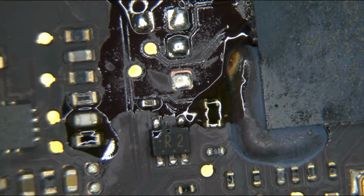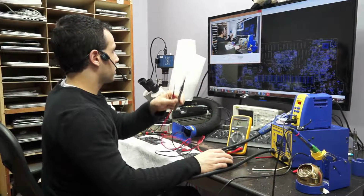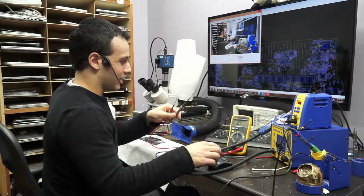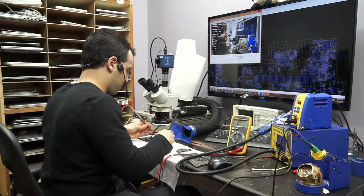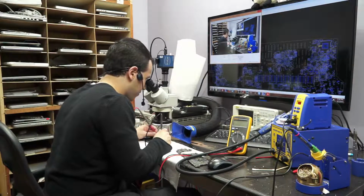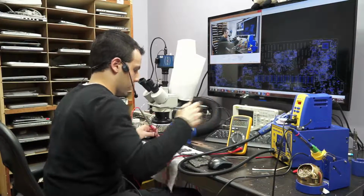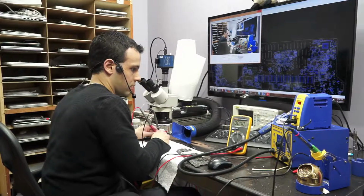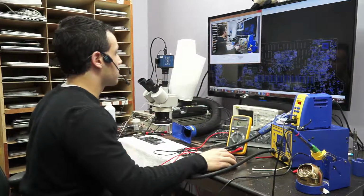Okay, now, just for curious shits and giggles, let's see if I've removed my short to ground here. I didn't click. It just changed over on the screen and I didn't click. Just from dropping the keyboard on my messy desk, it clicked. That's scary. Multimeter? How dare you try to save battery? Still short to ground. So let's see what the other capacitors here are talking about.